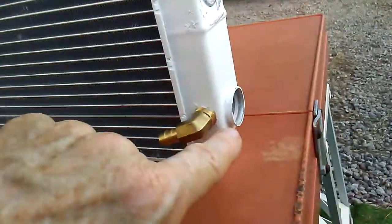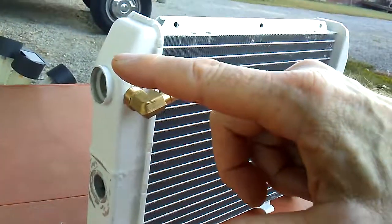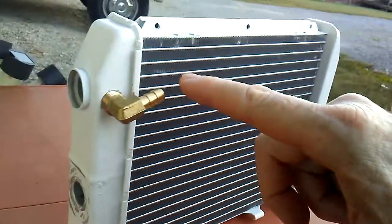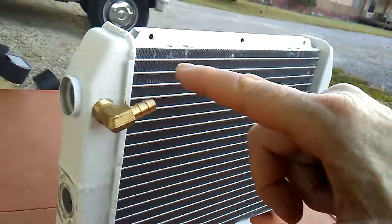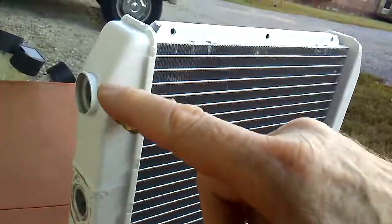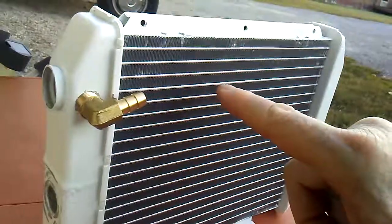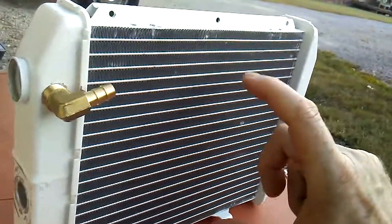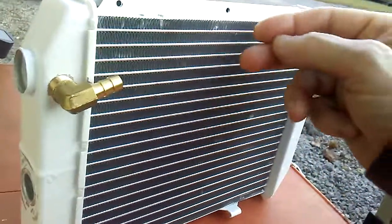But it's pretty close. So this one here, if you turned it on this side, I just happen to have the clamps already on there, so I just had it on that side. So if you do it this way, the top of the water flow at a crawl will be about right here, but the air box comes up pretty close to right between those two first water ports right there. So as you can see, if it's only full to here, then at most, when you're running the ice water slowly to preserve your ice, it'll be full to here. And if the fan comes up another inch or two up here, the surface area where it pulls the air across, then you're going to lose a little efficiency.